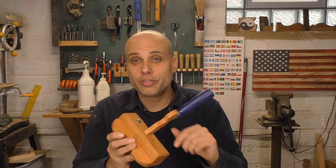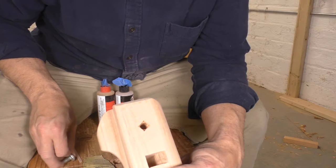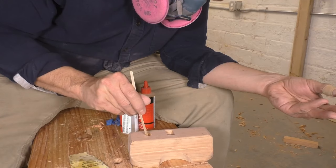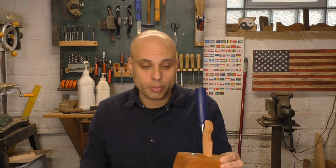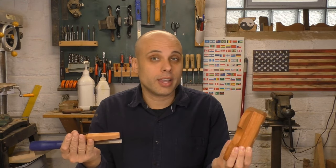I've got a solution to that. Here's the finished tool — what I've done is installed a strike button over here. It's just a carriage bolt that I've glued in. Carriage bolts have a little square section underneath the head, so after drilling a hole I also need to chisel out a little square where that fits, and then it's just a little bit of five-minute epoxy to drop it in. Once you have a strike button like this, adjusting the plane becomes easy and you really can't damage it. If you want more iron, you just tap the back of the chisel — no big deal. If you need to get the iron out, just give that strike button one or two good whacks and everything comes right out so you can reset your depth. You can really hit the plane as often and as hard as you want with a metal hammer and you're not going to damage it. It's a detail you see on a lot of vintage planes because it makes them last longer.